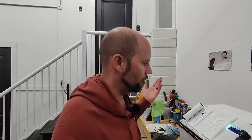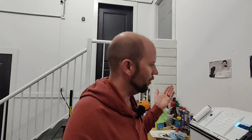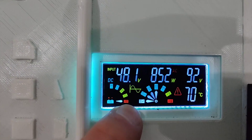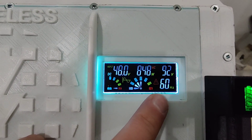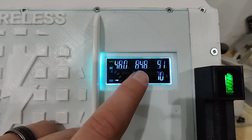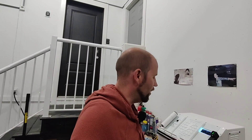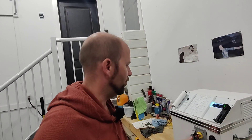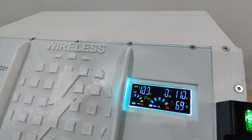It's been going for about two and a half hours, which makes perfect sense for a roughly two-and-a-half kilowatt-hour battery pulling almost a thousand watts the entire time. The inverter is beeping — it's showing it's nearly dead. As soon as it hits 48 volts it should stop. The temperature is at 70 degrees Celsius right now, pulling just under a thousand watts — it never got over 72 degrees, so that's good. It just hit that threshold and got an error, so we're going to go ahead and unplug it and let it cool down and shut off.